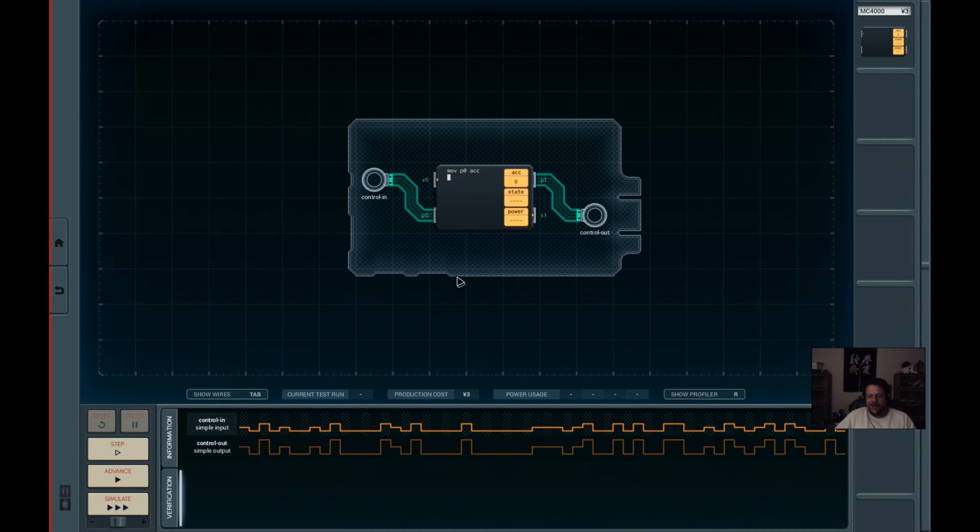And I am going to look this up. I'll actually pause and go look up the code for multiply. Okay, guys. So here's me checking the MC family microcontroller language reference. Under arithmetic instructions, we have the instruction MUL. MUL and a value. The value could be a register or an integer. So, multiply the value of the first operand by the value of the accumulator register and store the result in the accumulator register. So if we say MUL 2, we should be multiplying what's in the accumulator, which was the input from P0, by 2.